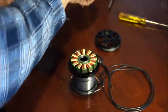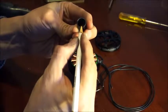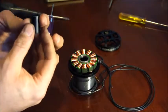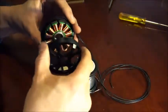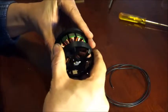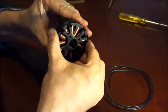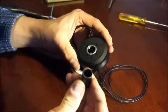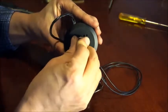So what we need to ensure is that the shaft is inserted back in with it lining up in that flat area. To do that, grab a pencil and mark right on the center of that flat area at the top of the hollow shaft, so you've got a marker to see where you need to line it up. Then put those two halves together again — they're going to grab with great force and snap together, so be really careful not to catch your fingers. It doesn't have to line up perfectly at this point, just close.